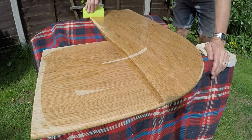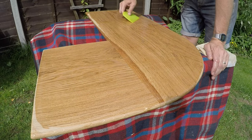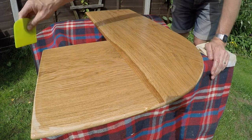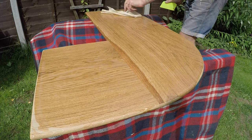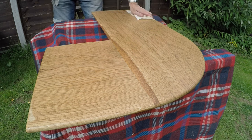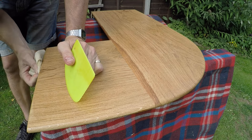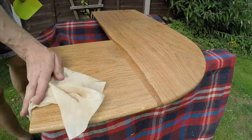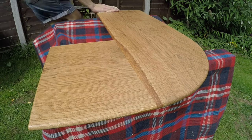This is the top. I've got the amount right this time — not much excess. You've got to be careful of drips down the side, because if you've got a thick bit you miss, that can cause a drip effect on the edge. Making sure to really work the edges, because the end grain takes a bit more oil to go in.